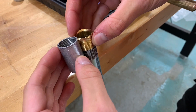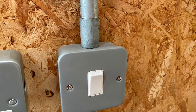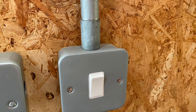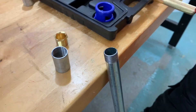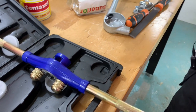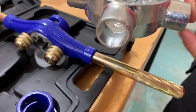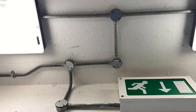We don't want them touching each other. So the common method of connecting a conduit to a socket or switch — metal clad, obviously — is to use a coupler. And what we've got there is a male bush. So we're gonna simulate doing the thread for that, and we're also gonna put it into a spouted box. So that just simply needs the conduit threading in order to go into a spouted box. We'll show both of those.